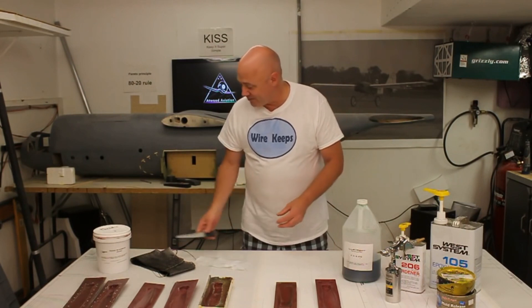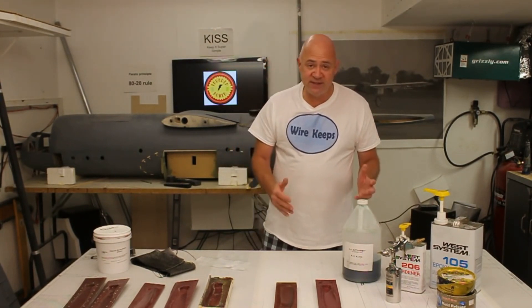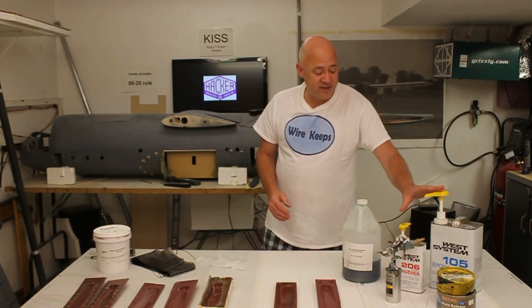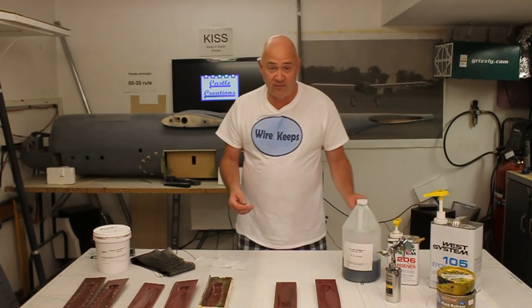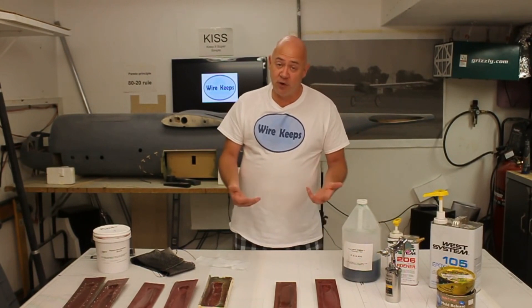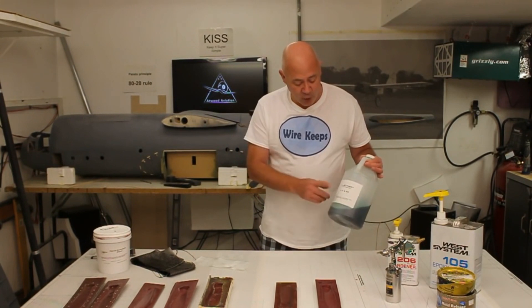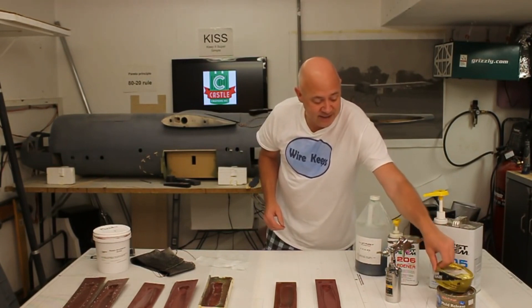What I want to talk about, with lots of pictures to illustrate, is what it takes to build one of these propellers. When I use resins, my epoxies are the West System — resin and hardener. The reason I like it most is because while these are two different sized containers, one pump of the resin and one pump of the hardener ensures the correct mixture ratio that will cure right. I use PVA-10 for my mold release, and used right in conjunction with wax, it will work perfectly when you go to release your parts.